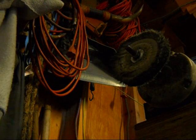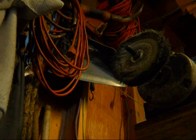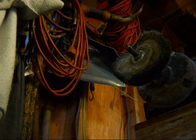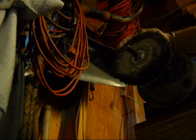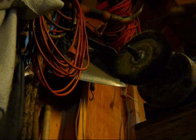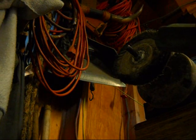For my buffer, I'm using a 1.5 horsepower pump motor that turns at 3,450 RPM. The wheel I've got on it is not ideal — it's rather worn out and soft. A 10-inch wheel would be better, but this is what I've got. To take scratches out you use a black compound, then a white compound, and finally a green compound for a polish. I'm just going to use the green compound and we'll see how that turns out.